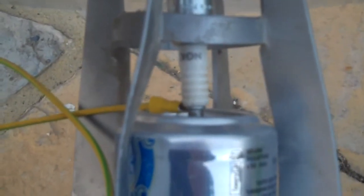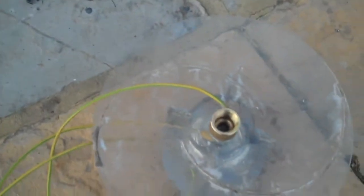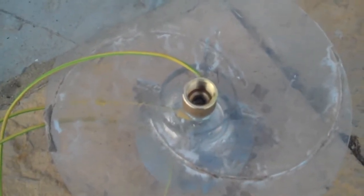What this is, is a spark plug, and the bottom of the spark plug is connected to one side of the capacitor series and the top case of the spark plug is connected to the other side. When I fire this thing, the spark jumps across the inside. Now, the reason there's a Coke can in the bottom there is I actually fired a tomato up into the air and it blew the spark plug out of the copper. So I rammed it back in and put this Coke can there so that when I do that experiment again, it doesn't blow the thing to pieces — which it did do last time. This little setup charges these capacitors from the mains using that transformer. When the charge gets big enough and there's enough voltage, the spark will jump across the spark gap and dumps all of the energy from those capacitors into that little brass chamber. And anything that's in that little brass chamber is basically going to blow up.